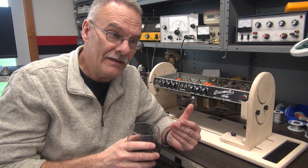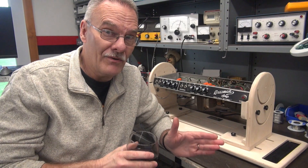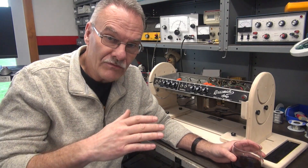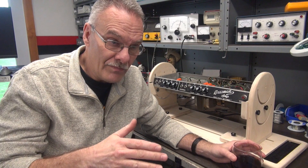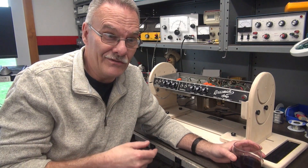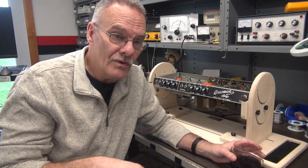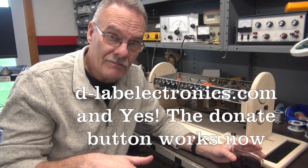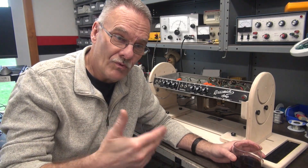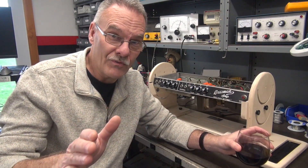I usually don't get that lucky, but somebody obviously had been in here before me and changed out all the major components. Thank God that power transformer wasn't bad — I really suspected that. So I have to contact the owner and see if there's anything else he wants me to do, but right now it's a pretty cheap repair — just a diode and a fuse, a few solder connections, and she's working. I just launched my new website, so check out dlabelectronics.com. Appreciate you all being there — D-Lab's back, we got a lot of cool projects on the way. See ya.